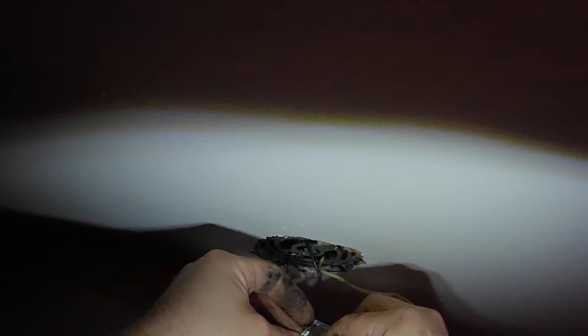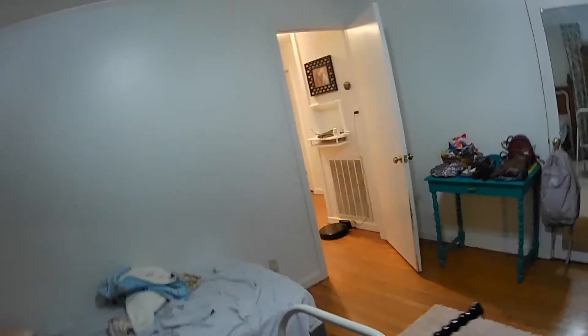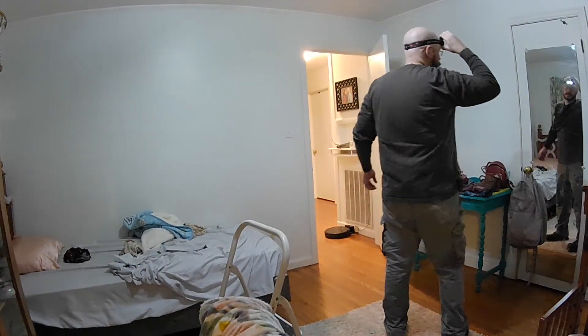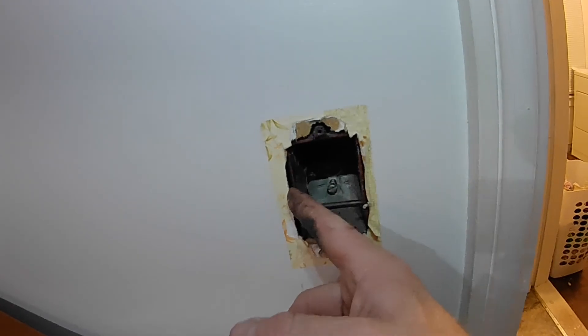On this light all the white wires wire together and all the black wires wire together. Just check all your wires to make sure they're not loose. Now let's turn the breaker back on and see if the light works. Now I've just got to attach it back to the ceiling and put the globe back on it — so this project is done. We'll cut this outlet box, get some sheetrock, and whenever we fill in the door we'll patch this hole.